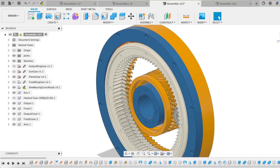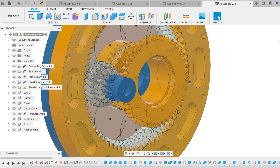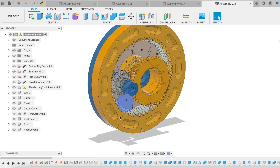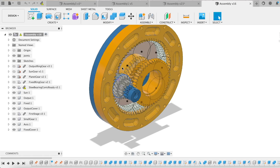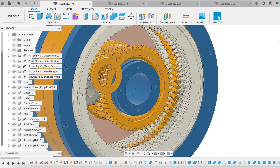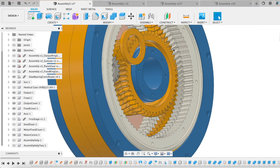But the problem is that this design is not possible to assemble, so I decided to go with helical gears on both sides — on the fixed ring and on the output ring. After that, I realized this was not a good idea either, so I changed the reduction ratio. The planet became too big and I could not fit eight planets inside. So I decided on a compromise: I still use helical gears but with a low helix angle, so they are almost like normal gears. Let's look at the 3D prints.